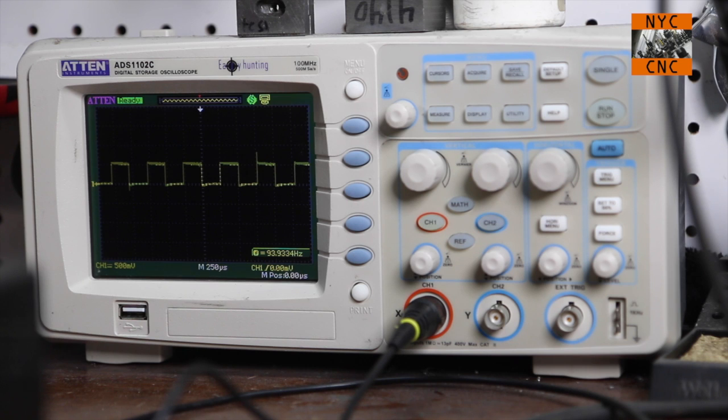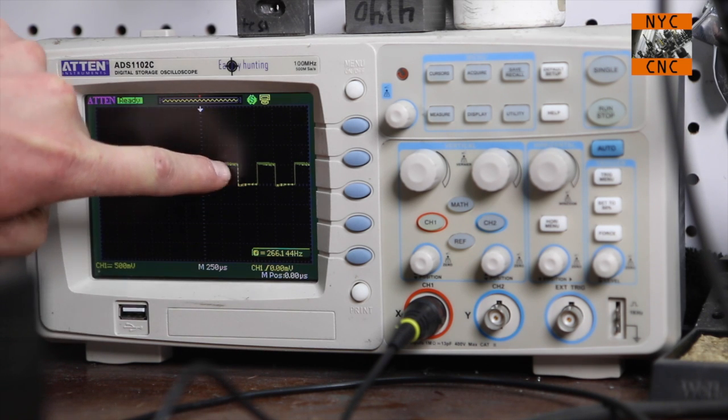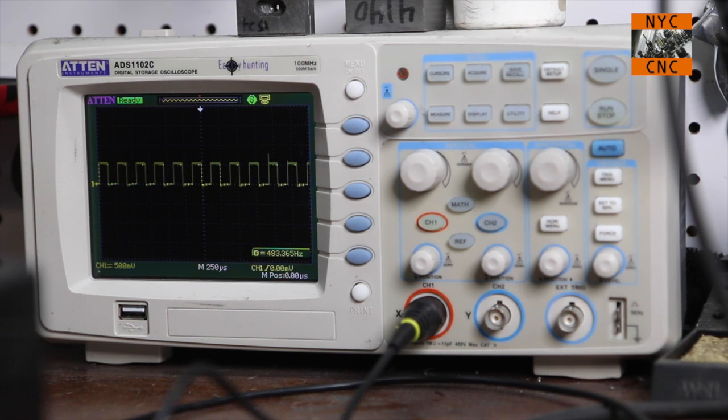When we run our stepper, you can see the interval up and down on the 250 amount. I'm actually running the stepper speed of 250 microseconds. Let's move that to 125 - updating the code, that should now become exactly half of that horizontal width. Done uploading. You can see it's exactly half, which is awesome. You can also see it's a nice, crisp, sharp rise and fall. Hopefully you guys who are in the know on this stuff can comment more below.